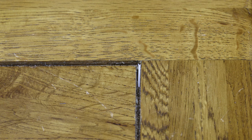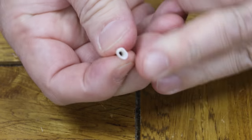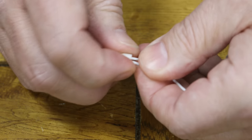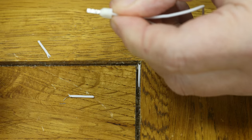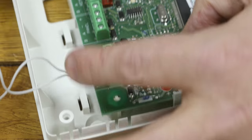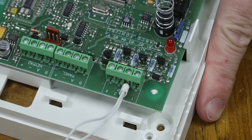Obviously if you want to put two wires in, especially with that shoulder, it's going to be tricky. What you actually do is get double ferrules — these are designed to take two wires. I've got two wires here; there's one twisted and another one. The double ferrule is a wider, bigger cylinder because it's going to take two wires. You just shove the two wires in there — it really is as simple as that. Then you use your decent crimp tool, and that's now nicely crimped flat. Cut it down to size if it's a bit long, and that will go in a screw terminal really nicely because it's nice and flat. Fits in really well — let me just screw it up. Look at that, that is solid — that's not going anywhere. Nicely crimped, no stray strands. Perfect.